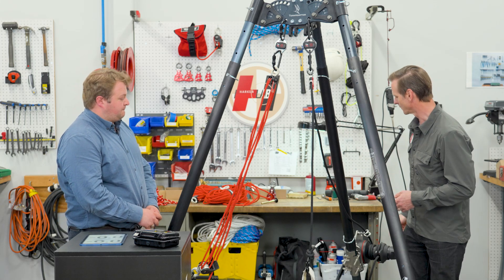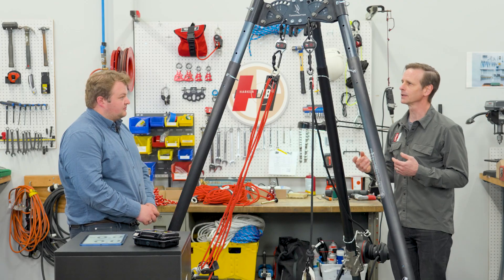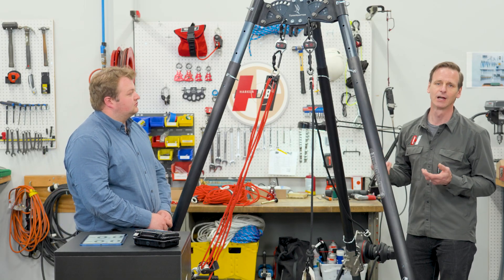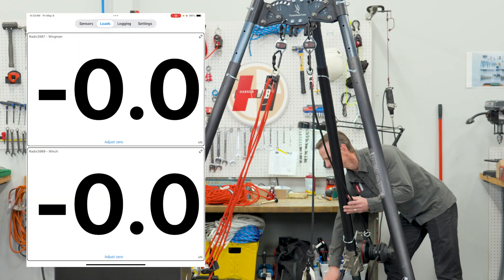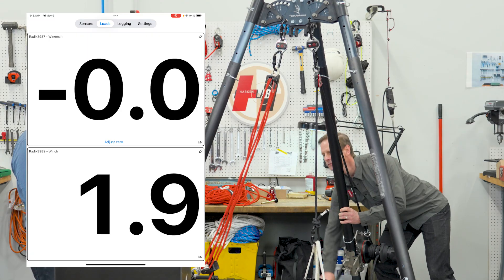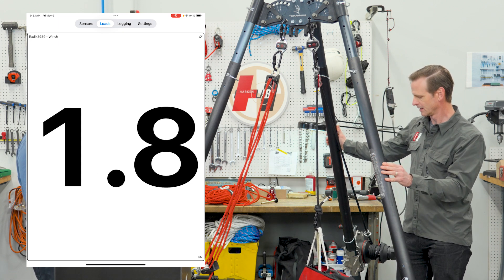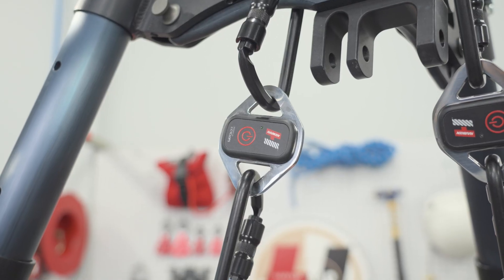What we're doing here is raising up this load on the winch and looking at the value we get. Where this really comes into play in the real world is when we've got a high directional and we want to know what the force is on that high directional, because we're always talking about what that result is. We look at the iPad and it's at 1.8 kilonewtons right now — that's a pretty significant load. We were trying to get close to two kilonewtons and it's doing that right now.